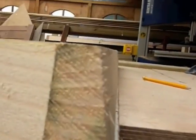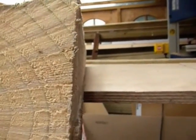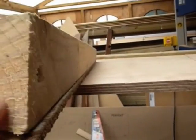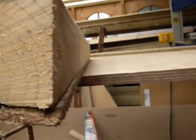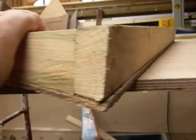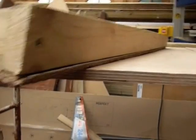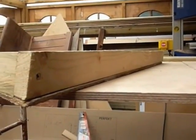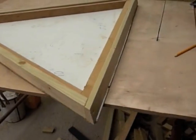This one here again slopes thin at the top, thick at the bottom. But when we go to the bottom, look at this — it slopes the opposite way, very slightly. Instead of thin at the top and thick at the bottom, it's thin at the bottom and thick at the top. This is what we call on the plans a negative angle. So if you ever see a negative angle, that's what it means — instead of the frame curving round this way, it actually kicks in on itself. We have to do that on a tunnel to get the shape to fit together.